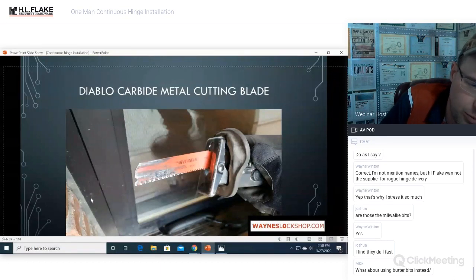They're used for safe work in most cases or drilling out high security locks. They work, but they cause more pressure. It takes way more pressure to get the carbide to bite in, I find, than a regular bit. So I still recommend the HSS bits for drilling through aluminum and milder steel.